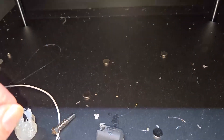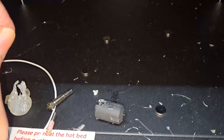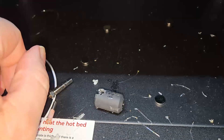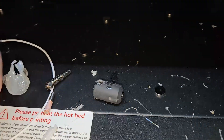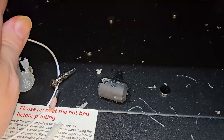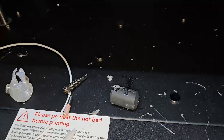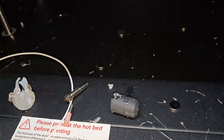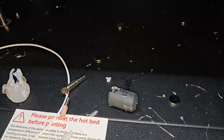You could take one of these brand new $20 nozzles and just snap them — no problem. This is the problem between a solid metal nozzle, which has less efficient heat distribution between the business end and the heat break, and the ceramic nozzle, which is by far superior because of the insulating properties, but very fragile. I think what happened is when it crashed the bed that one day, it stressed it enough to snap it.